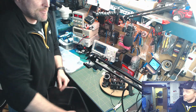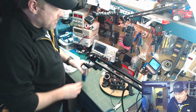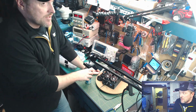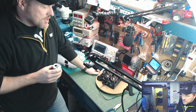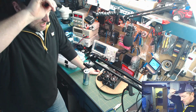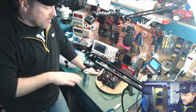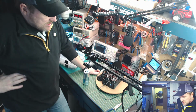Hardware comes first, and we're pretty close on the hardware here. Like I said, I couldn't be more happy with how this is running, and it's stable. The only thing that's cruddy is the web interface. The way the web interface is laggy. It's not super responsive. I'm not a web coder. It's just basic HTML, and the way the calls in the program are, I'm pretty sure I'm not updating it often enough. And then I was updating everything way too often, so I finally got the timing of everything right, where my telemetry and my firmware updating and everything only do things for a short time, and then they go to sleep if the Wi-Fi isn't on, or they have done it more than 7 times. Everything chills out, and all there is is the loop to run the randomness.